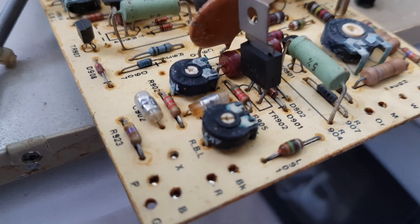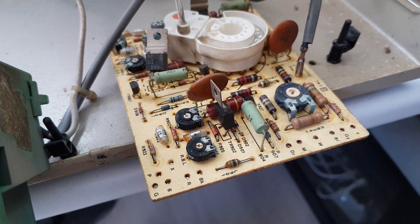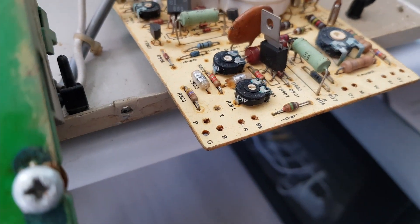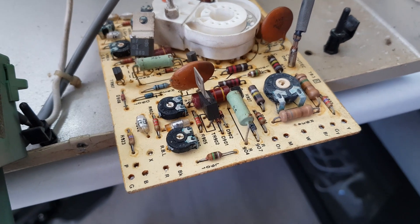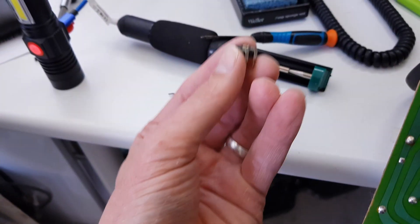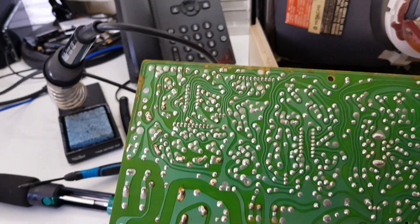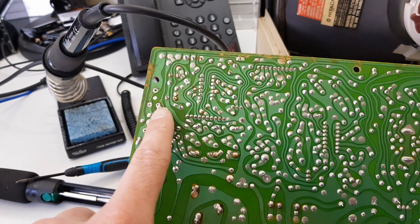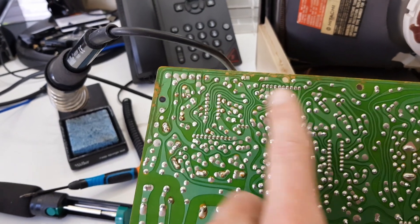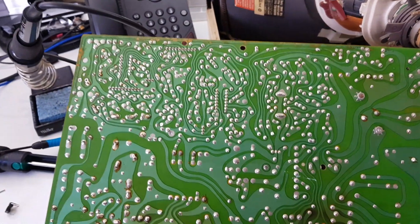The potentiometers have got the numbers written on them - this one says 4K7 and there's a 1K over there. As a quick test I've checked between the two ends of the track with the multimeter to see whether I get anything like 4.7K. That was quite a dumb way to do it actually - having desoldered it and taken it out of circuit, it measures 1.002K. The reason it's dumb is because on the circuit diagram most pots are between 12 volts and ground, so you end up measuring everything in parallel. I've had a good look around the board and I'm not seeing anything obviously broken.